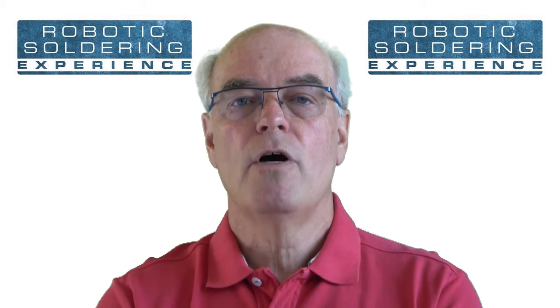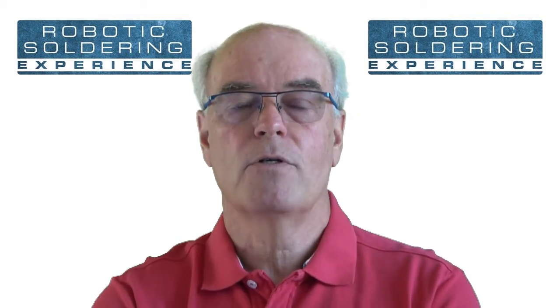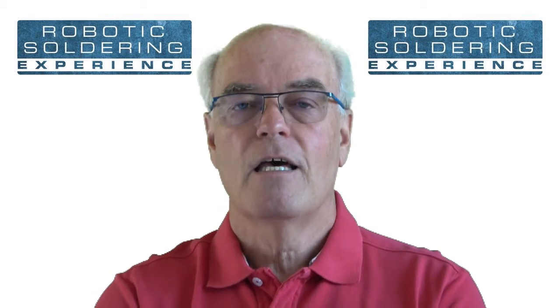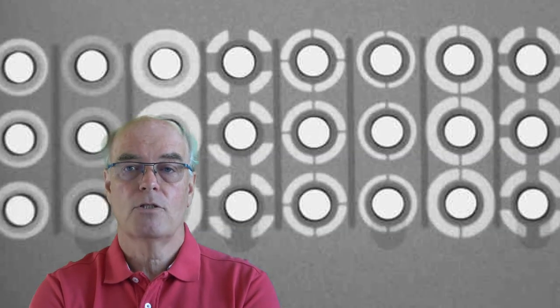So when we try and achieve 100% fill, that's what we want to be able to see. Ideally, we need to consider the thermal demand of the joint. And this is obviously the pads, the thickness of the board, the plating in the plated through hole, and the number of inner layer connections.